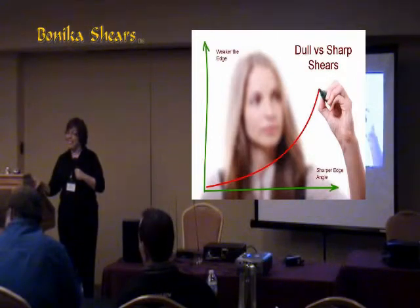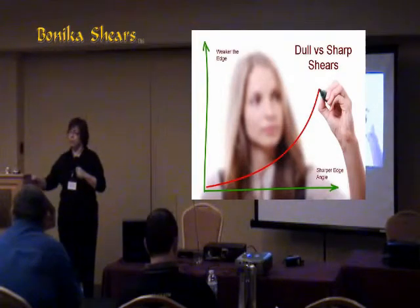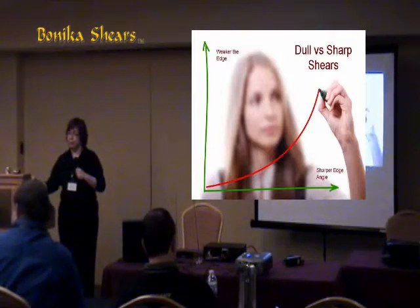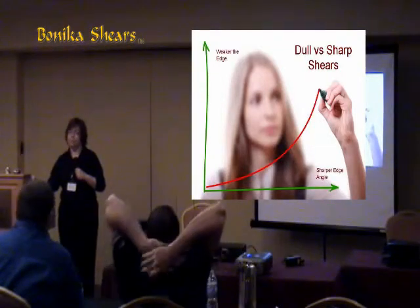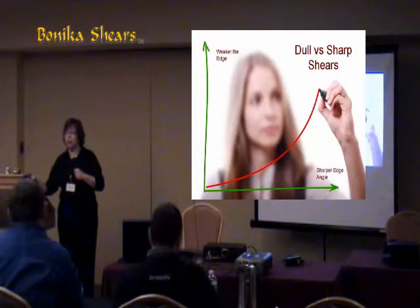According to Uwe, there's something magic about the 45, because supposedly that's when the force vector changes from push to cut. A lot of good sharpeners will try to always exceed 45, in other words, set their clamp halfway between 45 and 50 and get that 47, 48, which you can tell the difference, it works better, if it's a good metal.